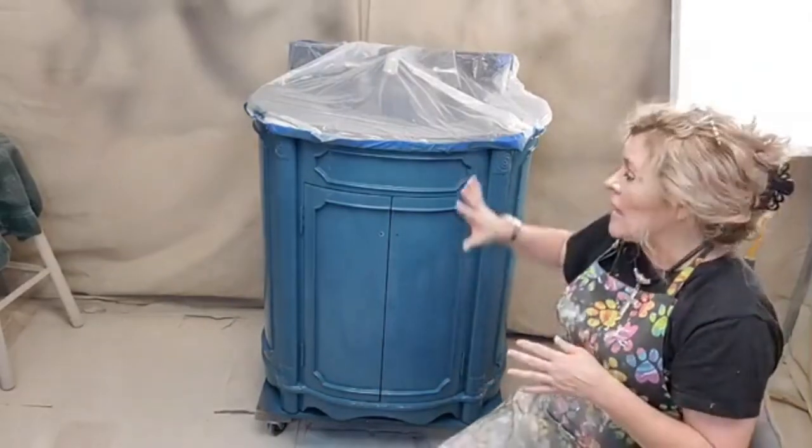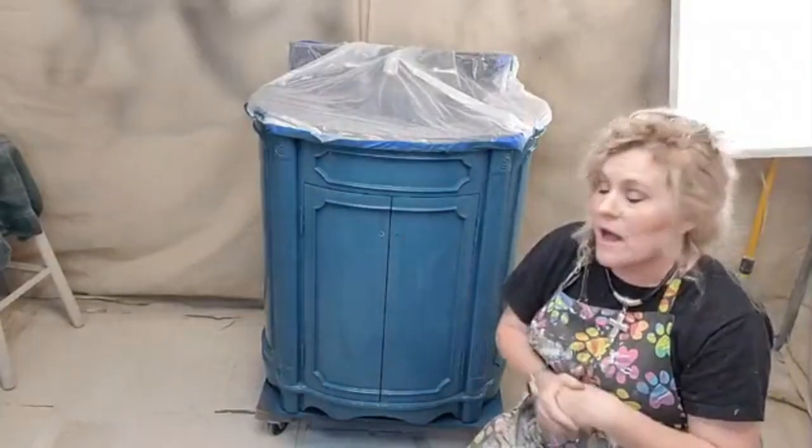And if you let your paint pool, sometimes you'll get crackle. And the reason you get crackle is because it starts drying underneath before it dries on top, and that's what causes the crackle. So if you notice that, then that's probably what it is. And if you're spraying something like a tabletop and you let it pool and you get a little crackle, take a 320 grit, sand through the little crackled part, paint back over it, and you're aces.